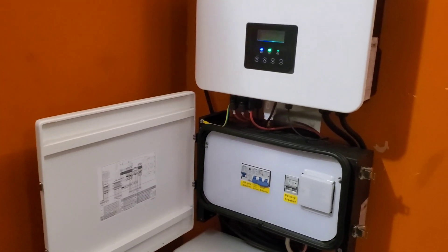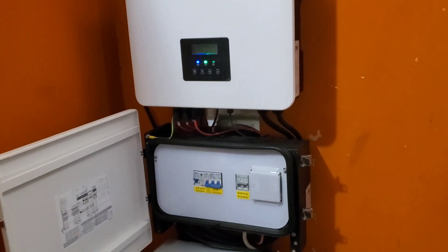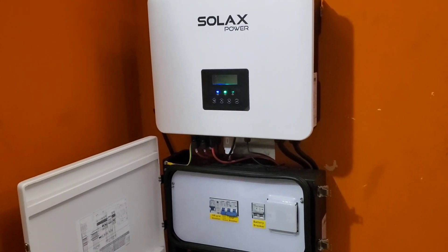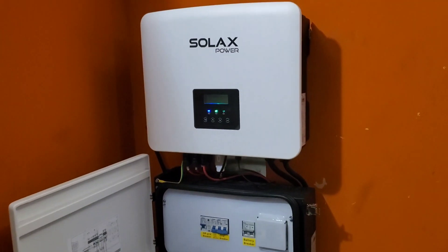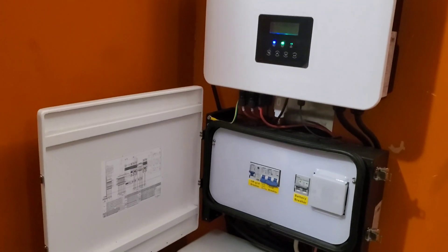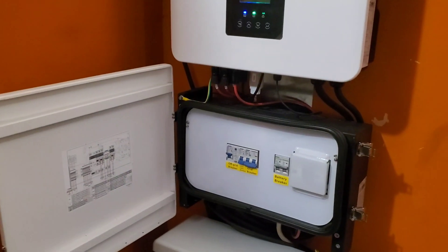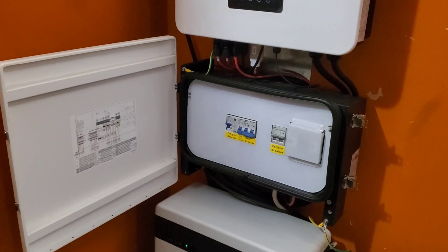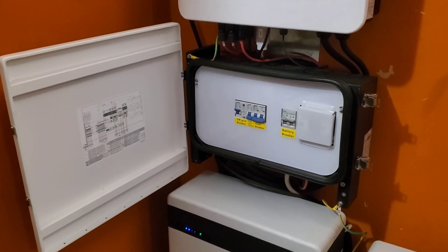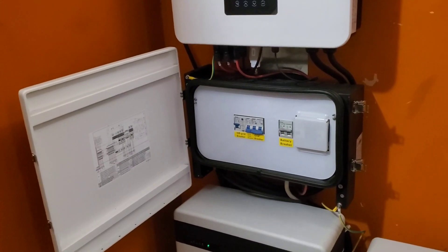These aren't pumps that require a surge — they're basically heating elements with no inrush current. And yet they've been tripping that breaker. There's no rhyme or rhythm; there's no particular time it does it, it just does it. One thing I noticed is that there's a hum, and if I leave the unit open with the fan on, it doesn't trip as frequently — though that might just be a coincidence.